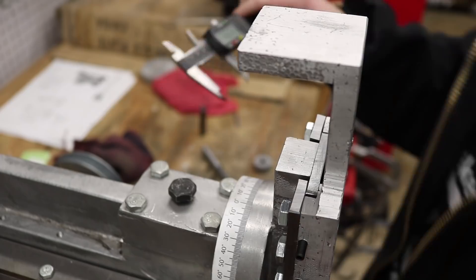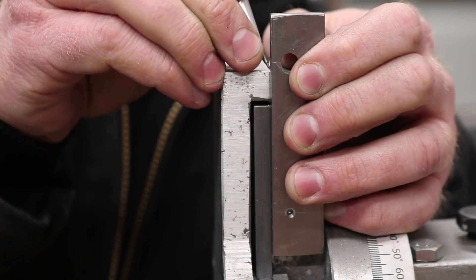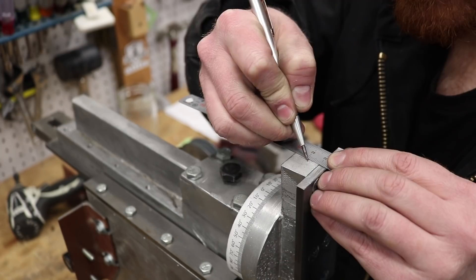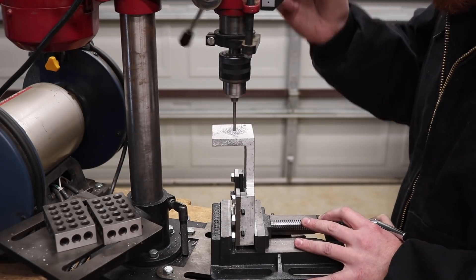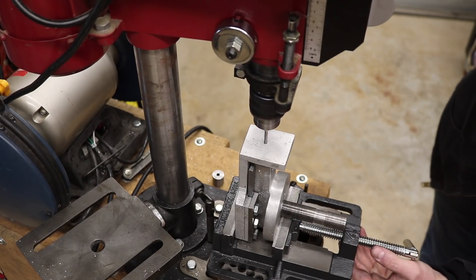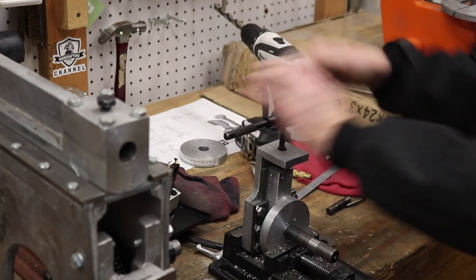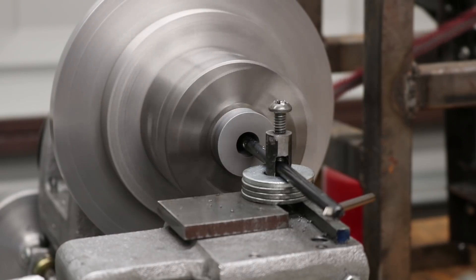I installed the downfeed on the downfeed slideways and used a series of straight edges and measurements to make markings on both the downfeed and the rotating head, so that way I could align the holes when I drilled them in the drill press. I took both parts off of the machine, mounted them in the drill press vise, and then drilled the initial holes separately. I then reassembled the downfeed to the rotating head, put it back in the drill press vise, and drilled matching holes. When I ran out of travel on my drill press quill, I had to transfer the vise to the floor and use my hand drill to finish it off. I used the holes as a guide to tap the hole in the rotating head and then I bored out that graduated cylinder in the lathe.